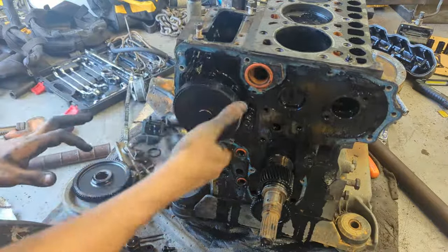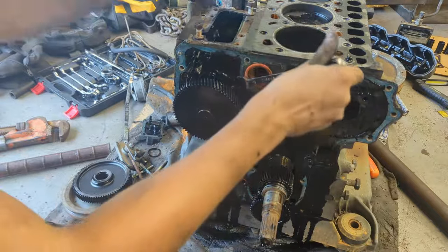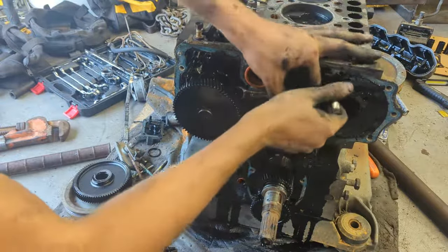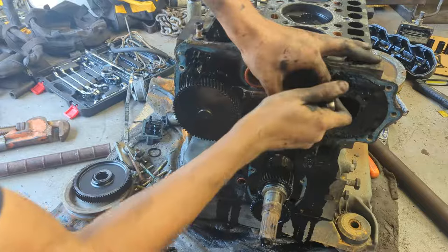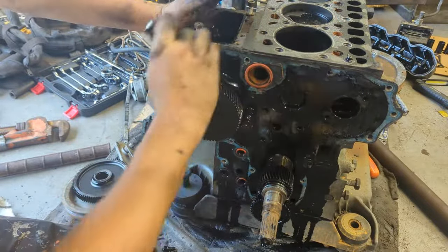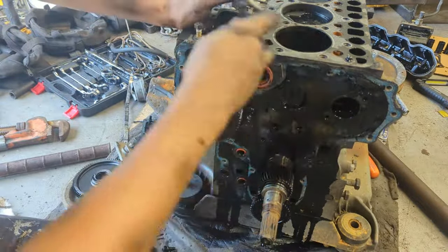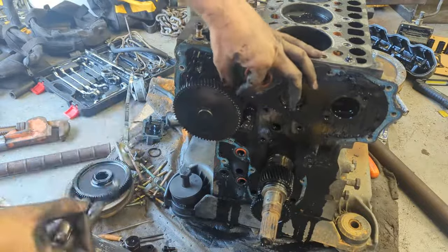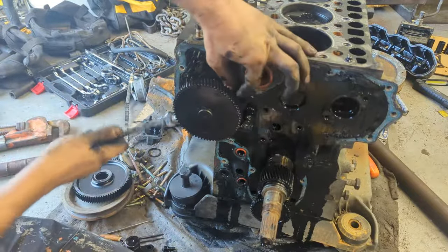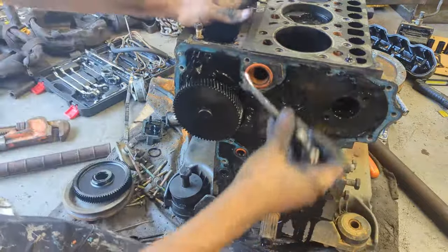As you're going to be servicing this governor thing, you can actually just take off the bolts on the back, and I suggest doing that instead, because it is a bit of a complicating thing trying to reassemble it. Probably is a pain. I definitely don't want to deal with that. So we're just gonna unscrew the bolts on the back of here. So one bolt back here. And I think that's it. Oh yeah, also there's one right here.